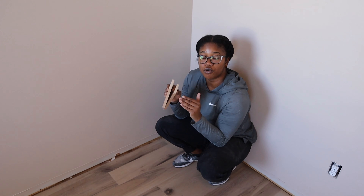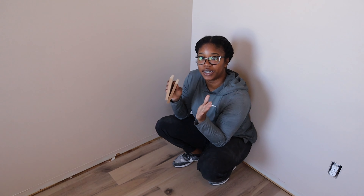All right y'all, all of the door casing inside of the room has been done. I needed to do that first before I did the baseboards because the new casing is wider than the old casing, so the measurements would have been off if I would have done the baseboards first. If you are changing out your door casing and your baseboards at the same time, you need to reinstall your door casings before you can do your baseboard trim.